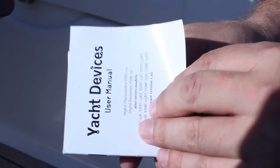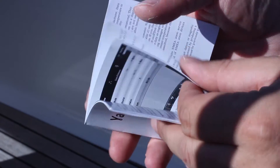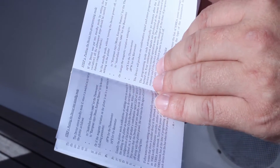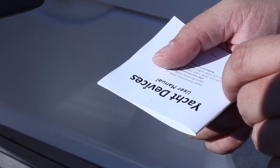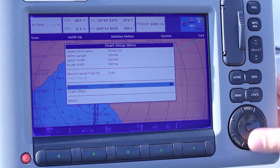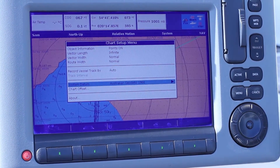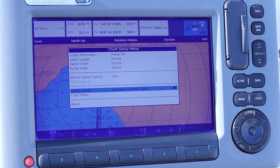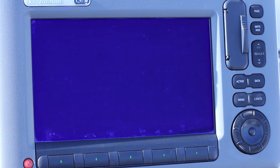In conclusion, we'll look at programming the thermometer according to the description in the manual. This can be done from practically any chart plotter by assigning values for chart datum or magnetic variation in a special sequence. This sounds a little strange, but unfortunately a more transparent and universal method for programming does not exist. We programmed the thermometer to return to factory settings by changing the chart datum. Now the air temperature is not displayed, but the device is working, meaning it is providing output for a different temperature, such as the engine room temperature. We set the chart datum to Australian Geodetic 1966 and turn the network power on. If the thermometer sees this setting when it is turned on, it will enter standby mode while waiting to be set and display a three-second confirmation signal.